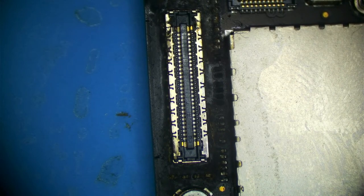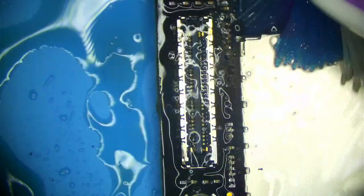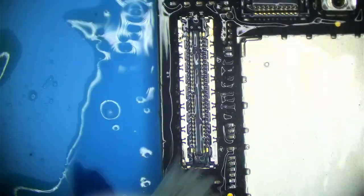We're going to clean this up just to prevent any crosstalk. We're going to pull the data off this board. We really only needed to get it to turn on and see the SSD so I could lifeboat it. Let's clean all this stuff off so I don't get crosstalk causing issues. And it doesn't look overly bad now. We do have some knocked off capacitors that were really bad.